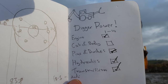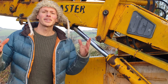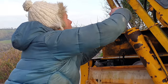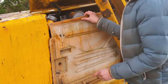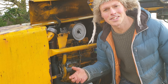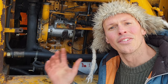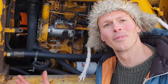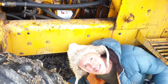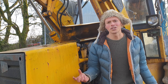Let's move swiftly on to the engine. We'll have put the engine through its paces already with the tests you've done, but here are a few specific extras. First thing to do before a good nose around in the engine is to put the safety strut down — this avoids any potential front loader crushage. A lot of this is about just looking for obvious faults like leaks. How do the filters look? Have they been changed in the last century? Dip the oil, check what that's like, check the water. Ideally we want to see the engine start from cold, so if you tell your seller that and you arrive and it's been pre-warmed up, you can justifiably be a little bit suspicious. Get your light out, get down, have a good look underneath for any puddles. If it's a machine as old as this, you can expect a little bit of black smoke when you rev the engine, but nothing major at all when it's just at idle.